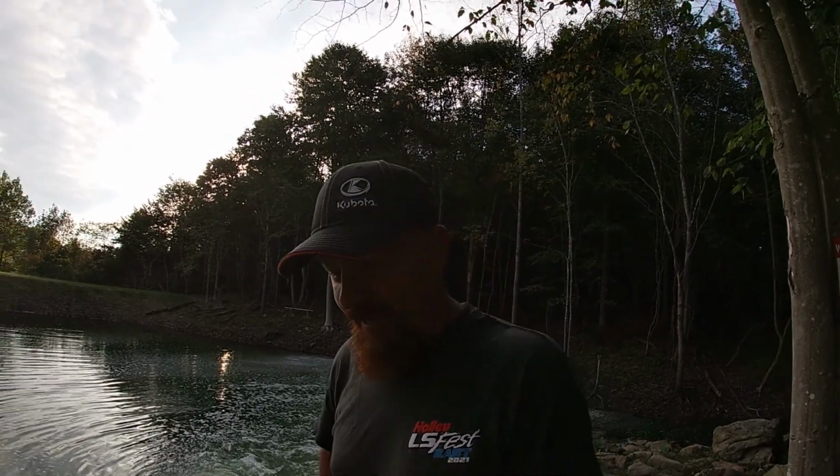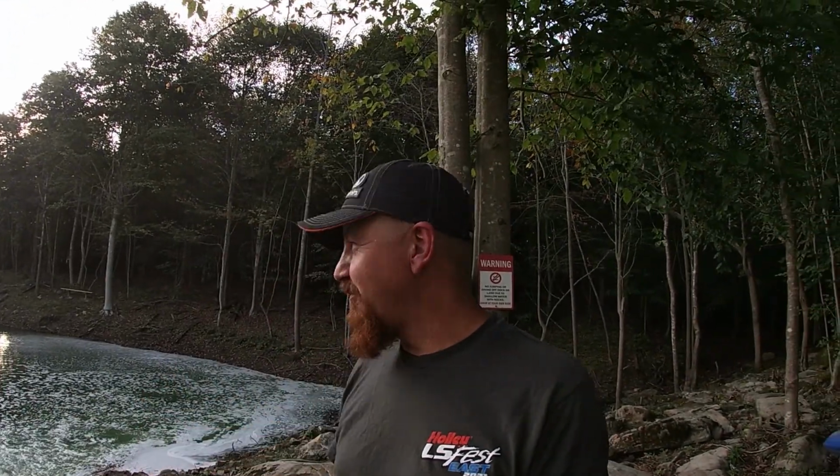So if you look online for these little Honda trash pumps, if you buy a genuine Honda seal, they're like $100. The cheapest I found a genuine one was $70. And you could order the cheap Chinese part off of eBay for $12. So it took a week to get here. It got here today. I had the pump already apart and ready to go. So slapped that seal in there, took about 5 minutes, brought it up here without the DB110, set everything back up and it primed right away, started pulling water and it's pumping real good. So we're good to go there.